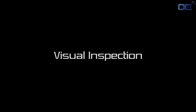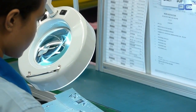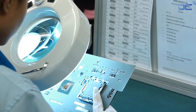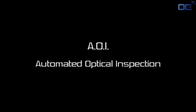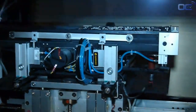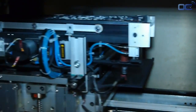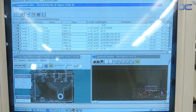Your mainboard now has all the small resistors as well as the chipset and the socket. It's time for visual inspection. This inspection avoids any misplacement or missing parts. Components smaller than 2mm can't be checked by humans, but the AOI — Automated Optical Inspection machine — is there for that. It checks if there is any missing or misplaced component, and also checks all components that have visible soldering points, like the audio chip.